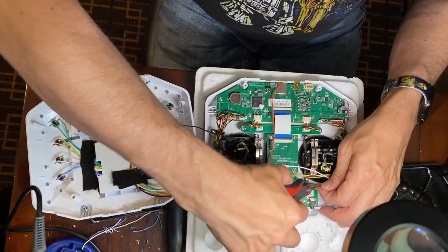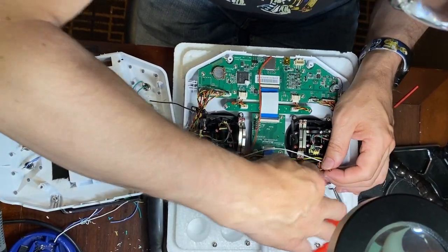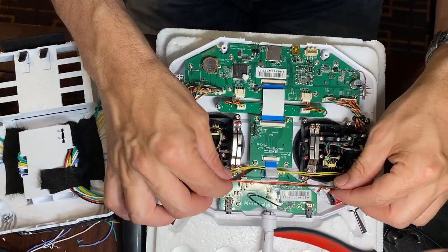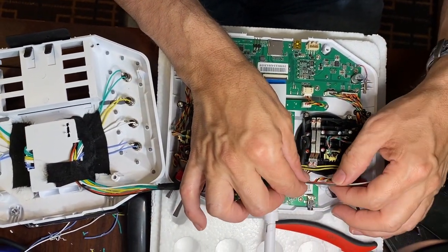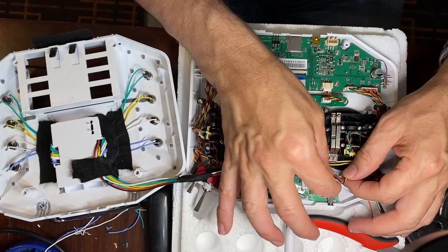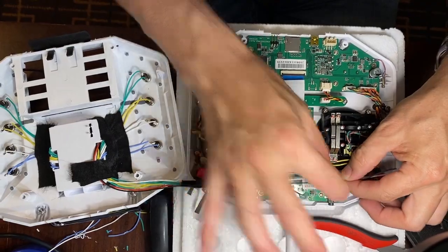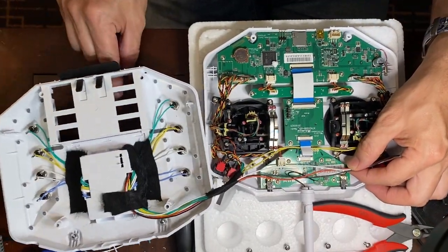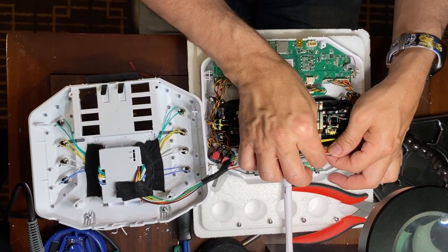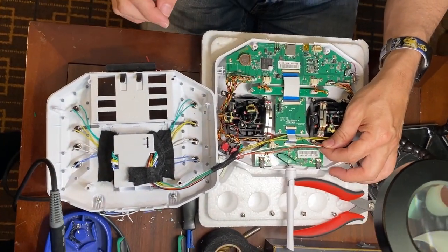Clip those three wires and just tuck those back in if you're going to leave that switch in there. And then what we're going to do is wire these three wires into this. The negative will go to the black, positive will go to the red, and then the signal is the yellow. So I'll get those wired in. As you wire those in, you want to make sure to use some shrink wrap. And once I get that done, I'll show you how that looks. All right, so we'll take a little break and we'll be right back after I finish that. See you in a bit.